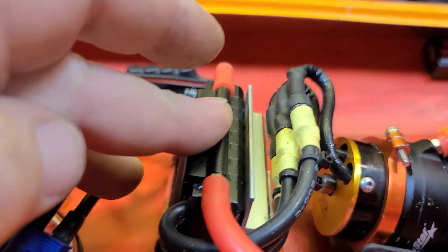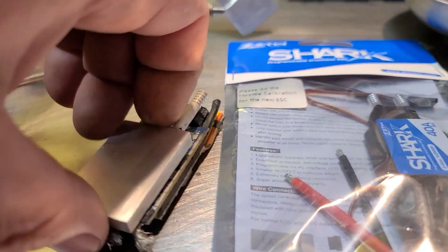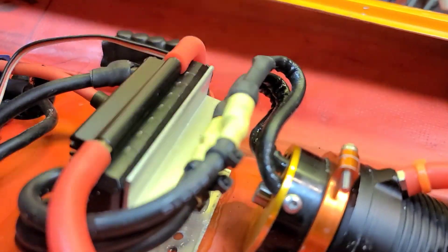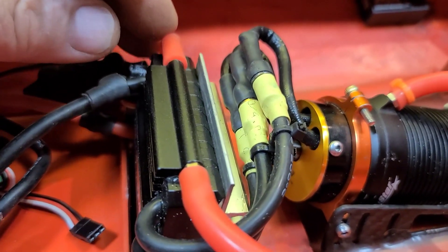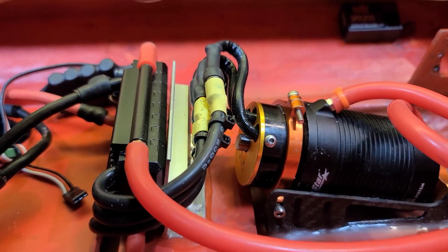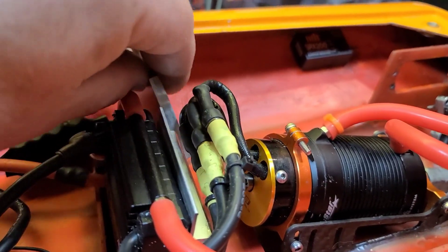Going to the ESC, we're going to use a water cooling plate that came off of an old ZTW Shark that I sank and blew up. We're going to use this plate on our vertical ESC mount. I made this vertical mount out of a piece of aluminum — the thought behind it was a little extra cooling. I have a previous video on how to make this ESC mount; I'll include the link in the description. But we're going to add a bit more cooling to the setup.